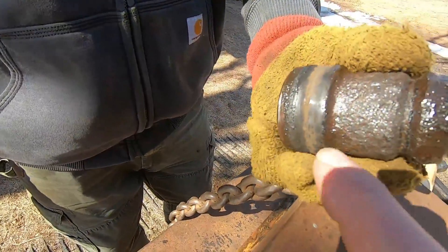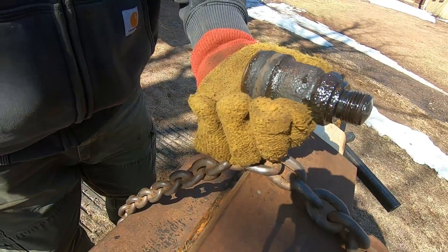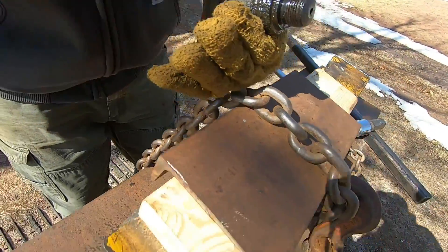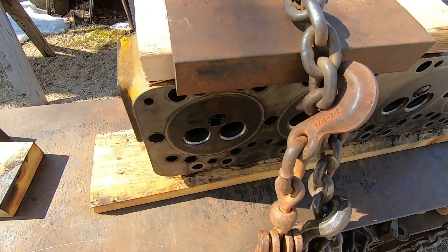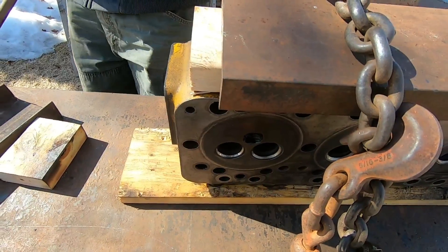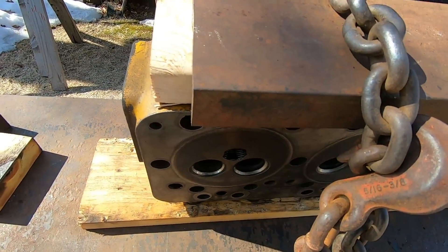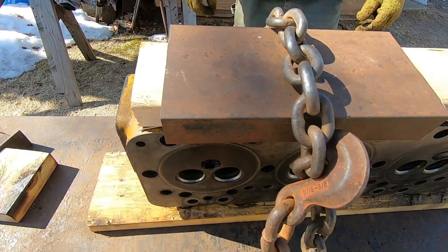The threads look good. You can see where we're binding — it's all crusty in there, buildup even over the o-ring. Not much of the o-ring left, but lots of good stuff on the threads. The reason we work it back and forth is that if it binds too much when you're down to one or two threads left, you'll pop them loose. Working back and forth keeps tension off those last couple of threads.